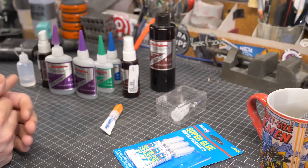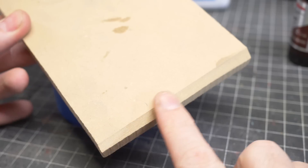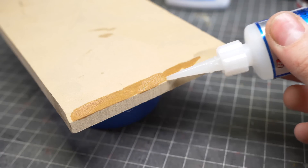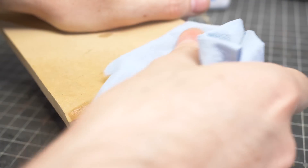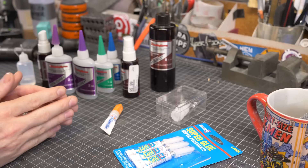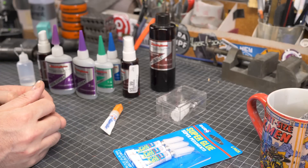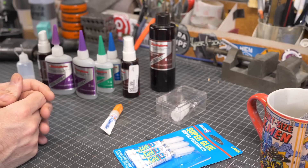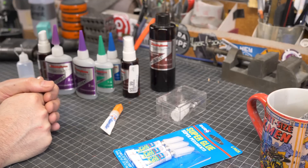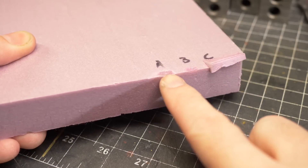I'll also use super glue to seal the cut edges on MDF. When you cut MDF, the edge is super fuzzy and hard to sand perfectly smooth. You can lay down a thick coat of glue and spread it over the surface — it will soak into the wood fibers, and when it dries you have a rigid surface that can be sanded perfectly smooth. Just know that when you're using a lot of super glue, try not to huff all those fumes. If your nose and eyes are stinging, go get some fresh air. It's possible to develop a sensitivity to CA glue, and if you're doing a ton of gluing, wear an appropriate respirator. I wouldn't recommend using CA glue on insulation or styrofoam — it will actually melt it.